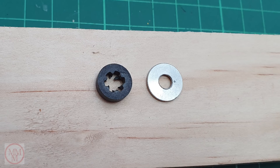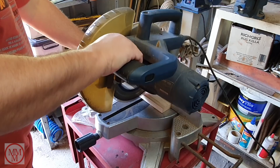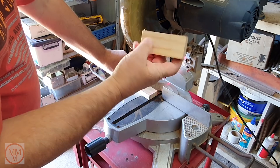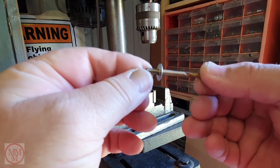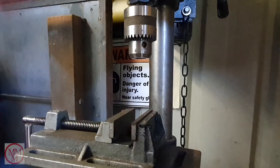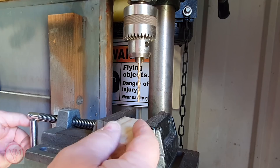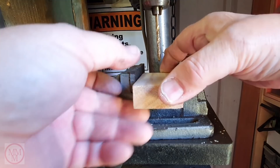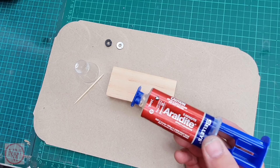So I'm trying to make up a little rig here to make it easier without breaking the wheel. I've just got a scrap piece of dressed pine here — cut off a little piece. I'm going to drill a hole in it. The idea will be I'll be able to hammer the axle into the hole and free it from the wheel. I've just got a washer here that I'm going to use as a support for the wheel when I hit it with a hammer, so I'm drilling a hole the same size as the inside hole on the washer.